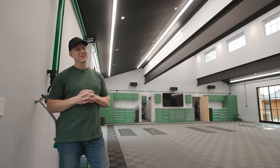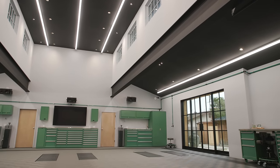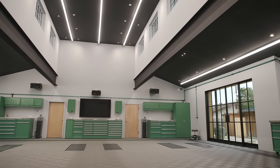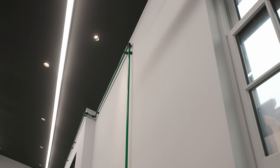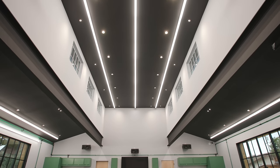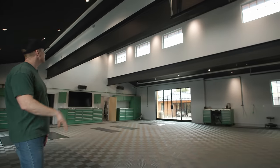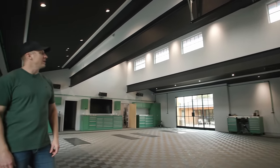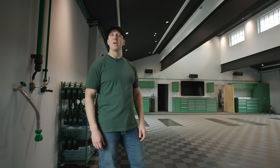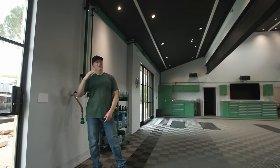This place also has dual purpose. Fred will be hosting all kinds of events. He's retired, and this is a really cool town — Los Olivoswe're about two hours north of LAX. At times he'll set up with tables and chairs. He owns a wine tasting company in town that his son runs. So he wanted two different types of lighting. The first is recessed ambient lighting at 4K — a little warmer. These are DMF lights. We're at around 60–70 foot candles, dimmable and controlled by Lutron RadioRA 2.